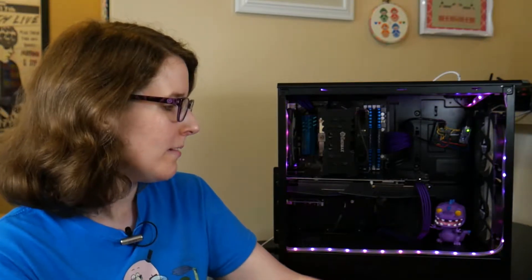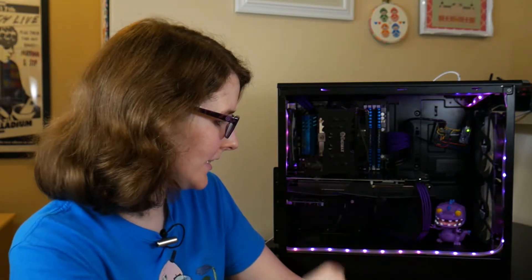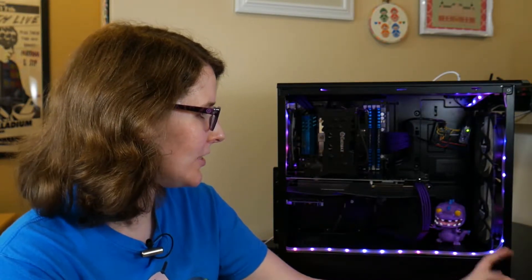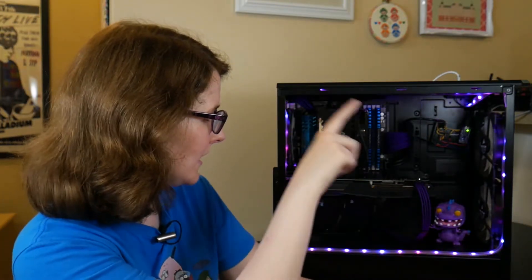Hey, what's up? I'm Liz, this is Blitzy DIY. If you've been sticking with the channel for a bit, you may recognize my computer, Reptar. More importantly today, you may recognize this LED light project from a video I did in about October. It's a NeoPixel project hooked up to the MSGEQ7 chip, which is an audio spectrum analyzer chip from SparkFun that allows you to multiplex seven bands on the audio spectrum to then be pushed out as data going into some NeoPixels.